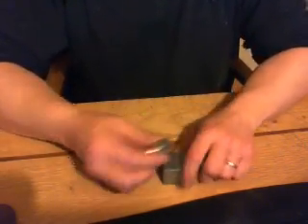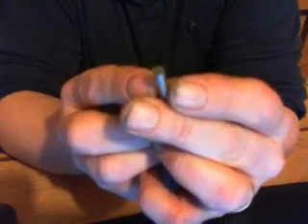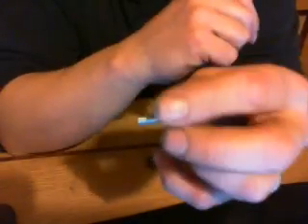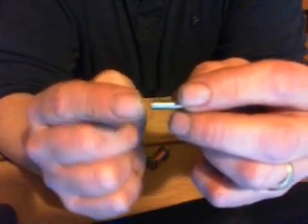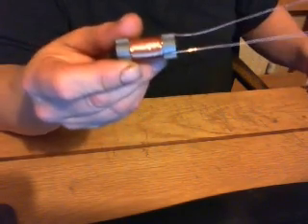This device has two rod magnets underneath — two centimeters by half a centimeter. You have a north and a south. One is an alnico magnet and the other is a neo N42 magnet. They're faced so that you have a north-south-north-south arrangement, and the pole pieces go onto the ends of the magnets with a coil around them.